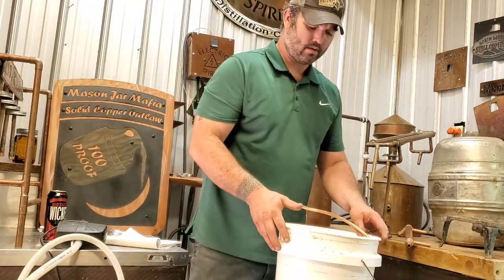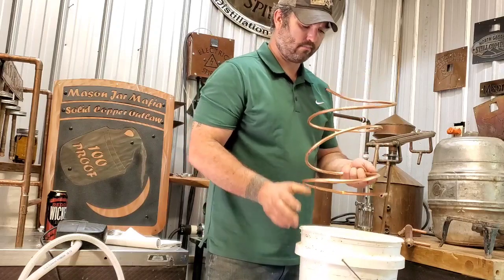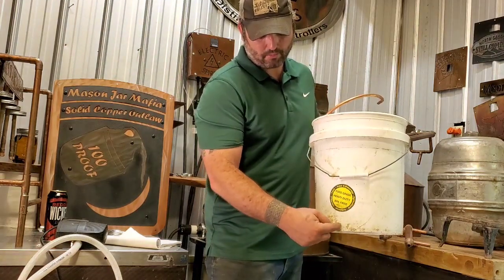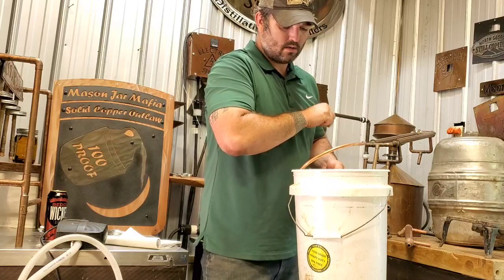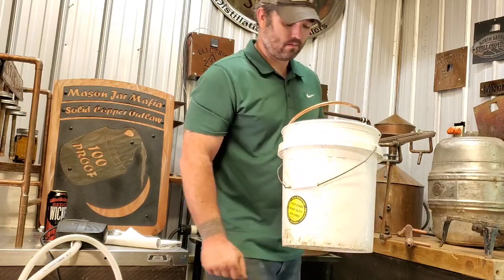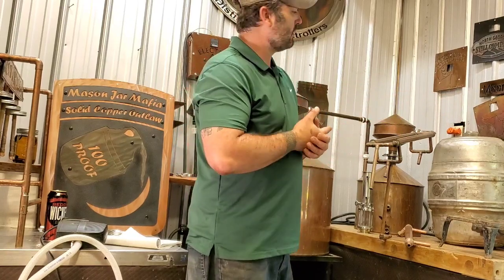Some of what you see in more traditional setups is called a worm. This isn't functional — I just had some extra copper and wanted to show you the concept. You have a bucket with cool water and a copper coil inside. Your vapor comes out of your pot and goes into the copper coil; at the bottom of the bucket there's a hole where the coil comes out. The cool water causes the alcohol vapor to condense as it travels down in a spiral and it comes out as a cool condensed alcoholic liquid. A worm works very well — I just prefer the smaller footprint of a jacket condenser.